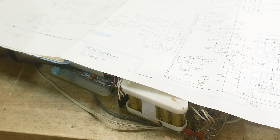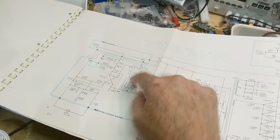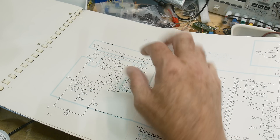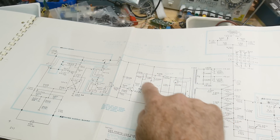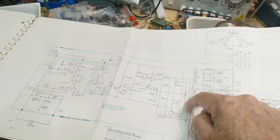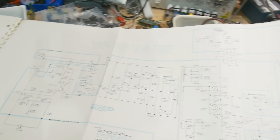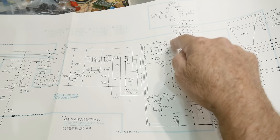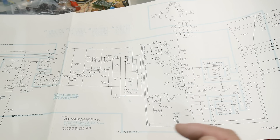You start out with somewhere around 12 volts with the two battery packs, then it runs into an oscillator that goes through a transformer — so it changes the DC of the battery into AC, goes through the transformer, and then through a regular power supply. The AC comes in, gets rectified, goes into the batteries — two batteries in series — ending up at 12 volts. The 12 volts runs into this oscillator section, which oscillates in push-pull onto the coils of the transformer, positive-negative, turning into plus 5, minus 5.